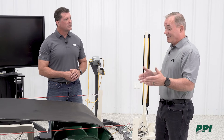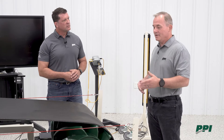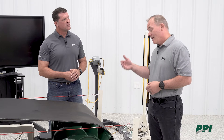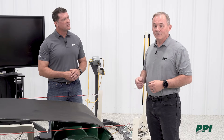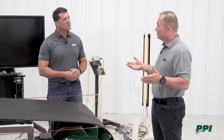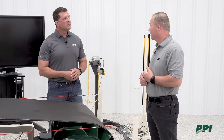In addition, pulleys are made for symmetrical loads. When a conveyor pulley assembly is designed, the left side carries 50 percent of the overall load and the right side carries 50 percent. When you skew the pulley, most customers don't even think of this, but it can actually cause bushing problems. You'll overcome the clamping forces of your bushings, and the next thing you know you have pulleys walking back and forth on the shaft.